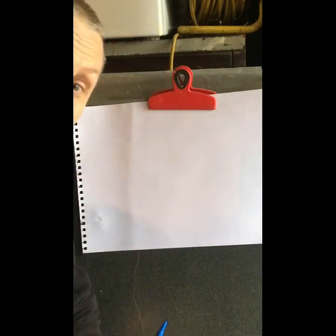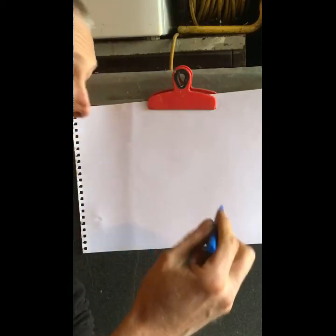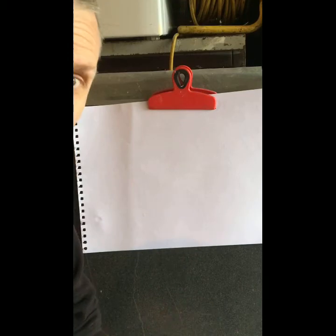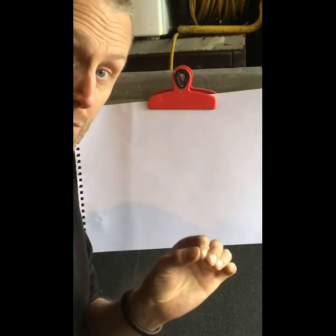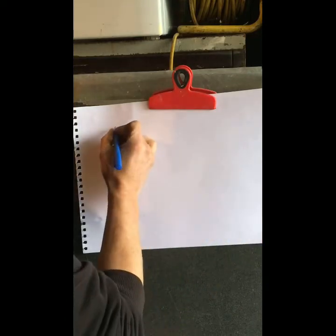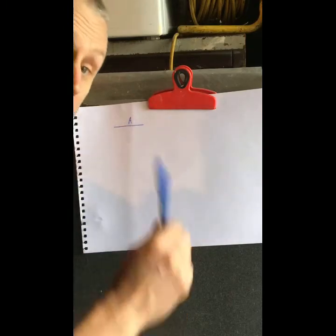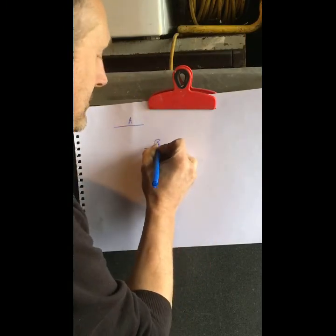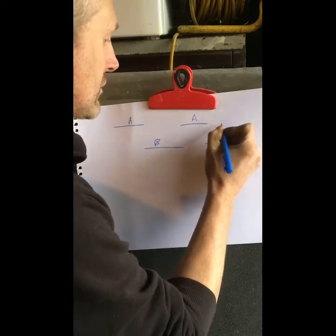Right, one last thing to mention about Asters and TI-21s, and it's not something people are readily familiar with, is the whistling noise you hear that's coupled with these track circuits. Now, earlier in the video I mentioned that obviously we don't just use one frequency for this track for safety reasons, we use two. So let's just say for instance we use a frequency up here, I'll call this frequency A. Our second part will be frequency B, and this will resonate back and forth. So we'll have an A, B and so on.